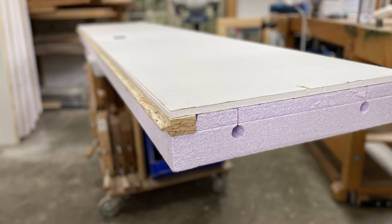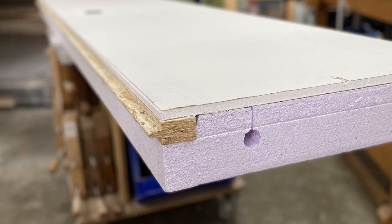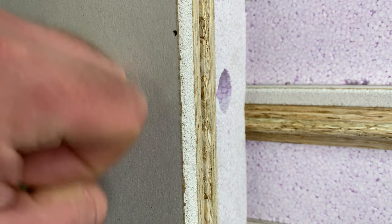The second reason I recommend DryCore SmartWall is because it takes much less skill to install than any stud frame wall, metal or wood. Simplicity makes the product perfect for DIYers, but even pros can appreciate when a task is made easier. These panels sidestep the need to cut wood or steel studs and plates, and that's quite an advantage if you have no experience of this kind. Since the drywall that's part of each panel is fully backed by rigid foam, it makes for a stronger and longer-lasting wall than drywall supported only by a hollow stud frame. You can actually feel how rigid the panels are, even as they sit in a pile — just give one a wrap with your knuckles and you'll see what I mean. There's no hollow wall feeling; it's really quite solid.